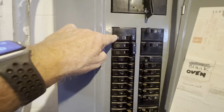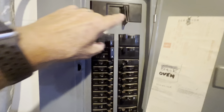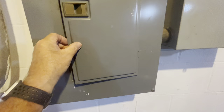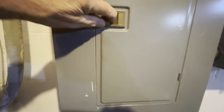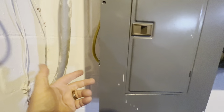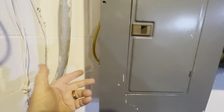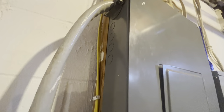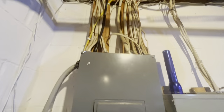Make sure all connections are good and tight — a loose connection will start shorting, the wire can wiggle and arc and cause corrosion and all kinds of problems. Once we did that we put the cover back on, turned the main back on, and put the panel box door and cover back on. Before turning anything on, I sent pictures of everything to my electrician buddy and he reviewed it. He said everything looked good, and the microwave came on just fine.